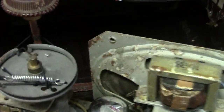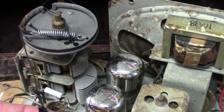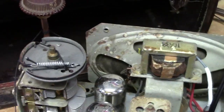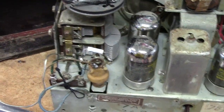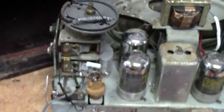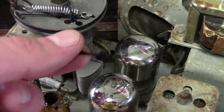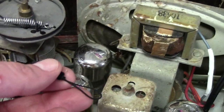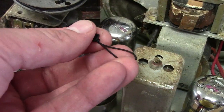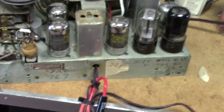I hooked this up so that it works kind of like those FM tuners that you might have seen — those types that use a variable inductor that you kind of pull a string. Some of those FM modules use that string type system. So as this tuning wheel turns, it just pulls on this little piece of dial cord which then pulls on the dial mechanism and holds it at the right place. I made a loop in this and knotted it so that the chassis can be removed from the cabinet for servicing.